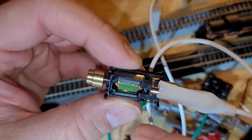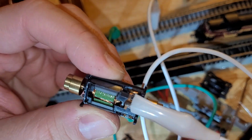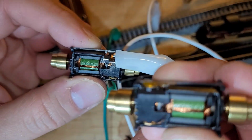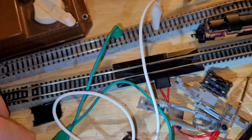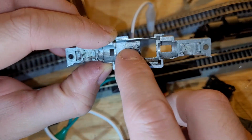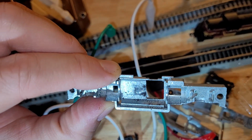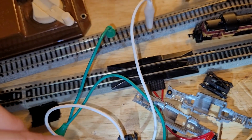You look at the winding right there. It's right across the actual motor itself. And that's not where it's supposed to go. So this winding is shot on that one. It's actually in worse shape than what I took out of the other locomotive. So that really is not a good sign, is it? Oh, boy. And if you look over here, this kind of confirms that, because if we look at the chassis here from that one, if I can figure out which one it was again. Oh, right here. This clearly made contact with the frame, which is probably how it fried that other decoder. So this thing is really shot. It's worse than I thought it was. So, I evidently need a new motor, and I can't use these parts.